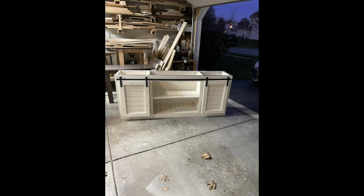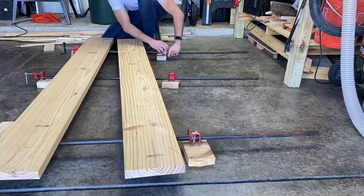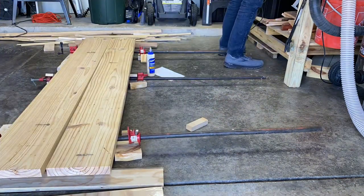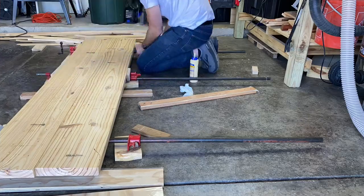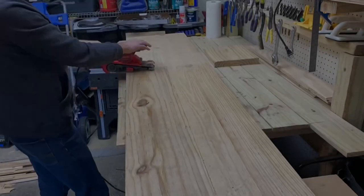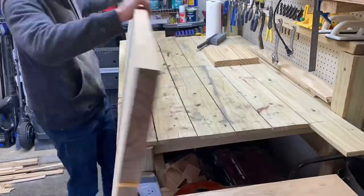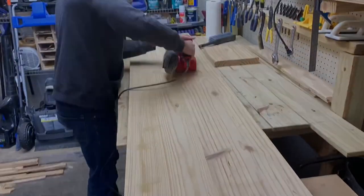Clamps are going to be your friend here, so make sure you dry fit everything first before you commit. Now we're going back to assembling the top — this is kiln dried lumber from Home Depot, a two by eight material. I'm gluing it together so it's the correct thickness; I've already jointed and cut it with the table saw to length so it goes together seamlessly. If you don't have a jointer there are ways to do this that I won't review here — there are plenty of videos on YouTube. Next step is to get everything sanded, which was definitely the longest part of the whole project. This is the part the TV will sit on and will be most visible, so I want to make sure that seam really disappears or is at least smooth.